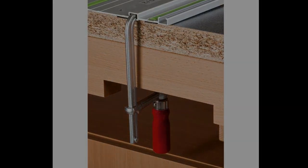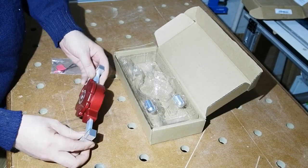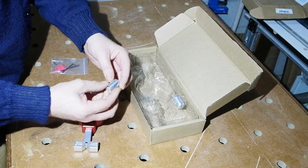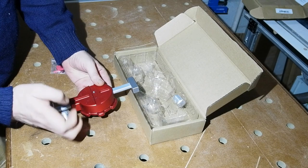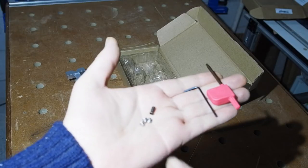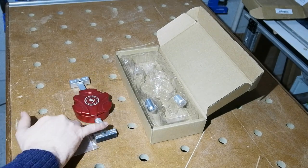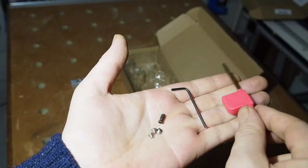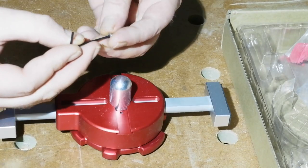This next clamp I was excited to try - not only is it a solid aluminium linear bench clamp, but it's Hongdui branded. Regulars will know I've generally been mighty impressed with kit carrying that branding. In the box you get a little tool kit with screws, the clamp itself, and two dog options: one is 19mm or three-quarter inch, the other is 20mm for MFT grid-type benches. I'll be using the 20mm option. The underside of the clamp body has a T-slot for the dog. To stop it slopping about you'll need to add a little screw, which you'll find in the tool bag along with two spares, a spare screw for the clamp feet, an allen key for the small dog screws, and a Torx for the clamp foot screw.